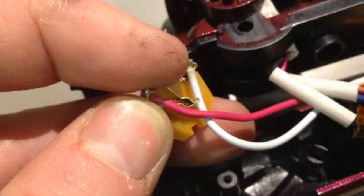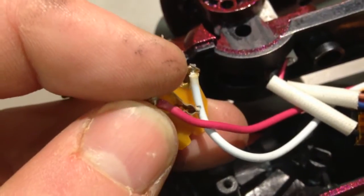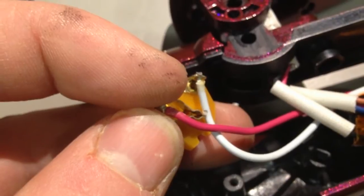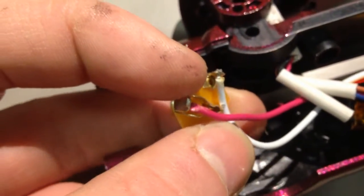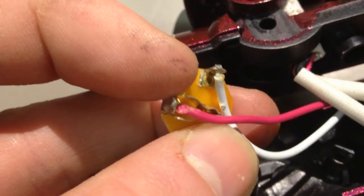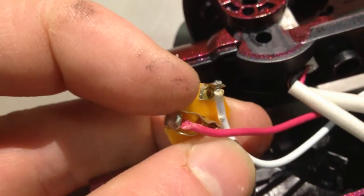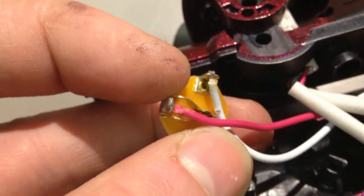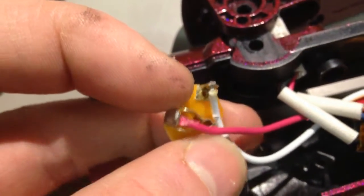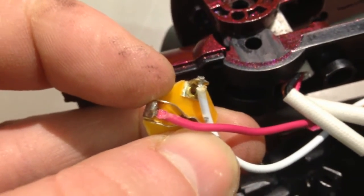What's going out of focus. And there's also, if you can see on that white wire, there's a bit of pitting in the insulator. I don't know if that's melted or actually been chafed. Either way, it's not good, because eventually there'll come a point where that thing just goes through the insulator, and it's 240 volts on here. You wouldn't even need to chew it all the way through and it'll just short out. It'd definitely fail an insulation test, that's for sure, if it carried on like that.